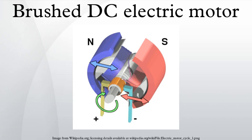Permanent magnets have traditionally only been useful on small motors because it was difficult to find a material capable of retaining a high-strength field. Only recently have advances in materials technology allowed the creation of high-intensity permanent magnets, such as neodymium magnets, allowing the development of compact, high-power motors without the extra real estate of field coils and excitation means. But as these high-performance permanent magnets become more applied in electric motor or generator systems, other problems are realized.